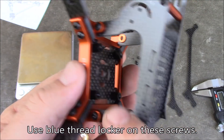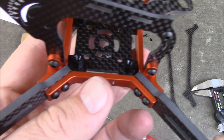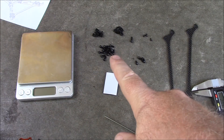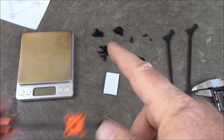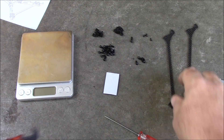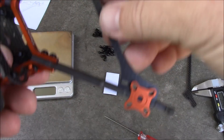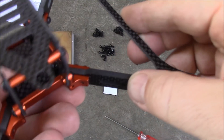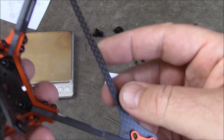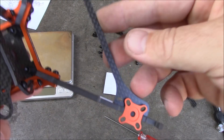It comes with a set of nylon spacers — in fact, it comes with three sets. It also has a lot of extra 8mm screws, and those run through the carbon fiber pieces on the side to provide a little bit more strength. Since the arms are running vertical, there's not a lot of strength forward and backward, so this little piece allows the strength from the arm in the front to help the arm in the back and vice versa.